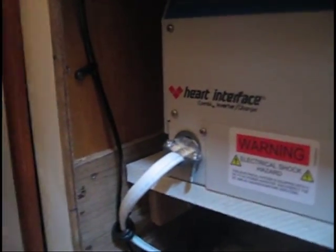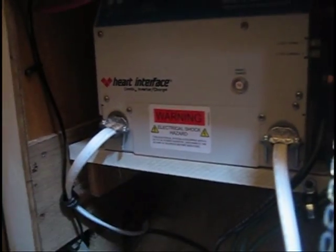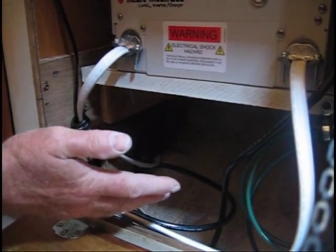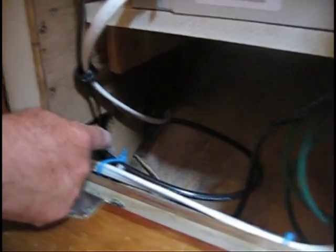For the purposes of this installation, we chose a disused locker which is directly below our battery compartment, yet isolated from it. Ventilation is adequate, and there's plenty of room for both the inverter charger to sit on a sturdy shelf which we've fabricated, and also allows us access to any other components required of other boat systems — in this case, a service nut for a through-hull fitting.